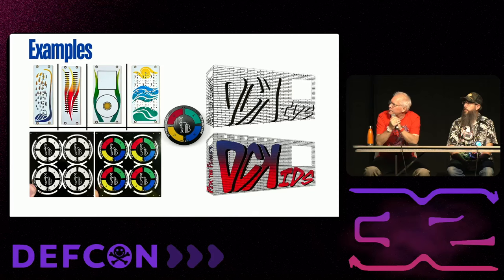One of the challenges is that it doesn't scale that well. The 2023 challenge coin — I order PCBs from the manufacturer in black and white, where white is anything I want to be colored, and then I silk screen each color separately. One color is one entire silk screening process; two colors is two processes. That board had to go through the silk screening process four times, meaning UV exposure four times — so it's good for adding a couple of colors, but you don't want to go wild with it.